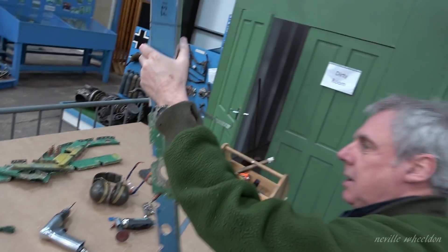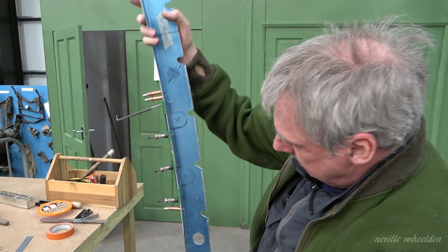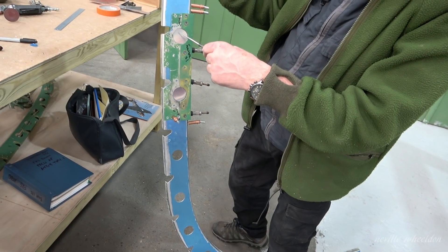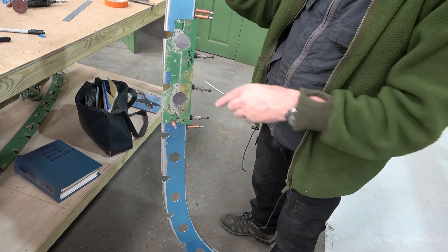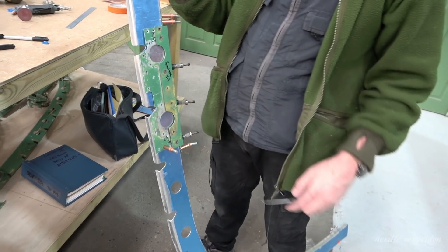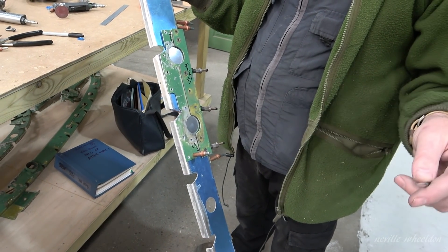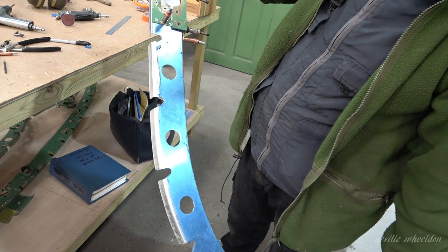The other one, just like that. I haven't cut the hole just yet, but that's how it sits in the aircraft and the two control rods go through there. Interestingly, the Canadians made these brackets and cut these notches so that you can get the control rods out through the frame. Whereas on Jane, this is just one solid reinforcing plate and you have to feed the control rods when you build it. So it must have been done to expedite removal of control rods or to expedite the assembly process.